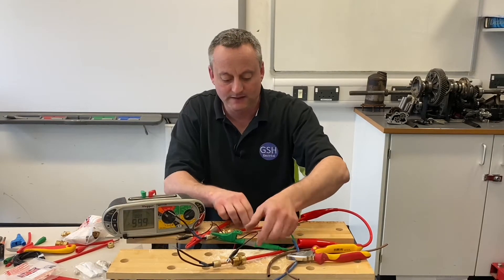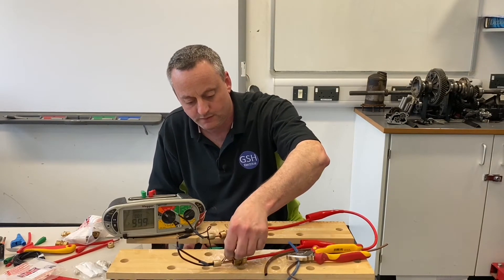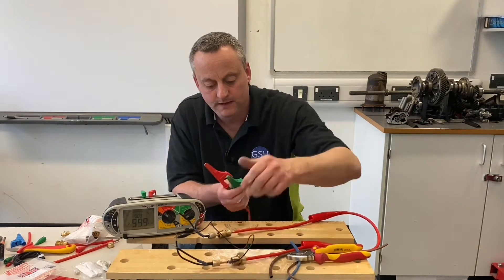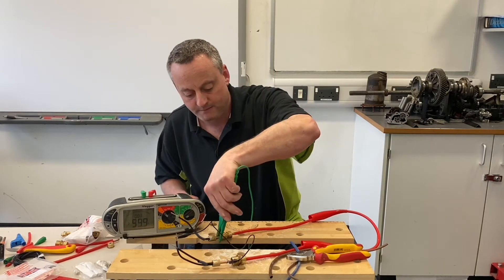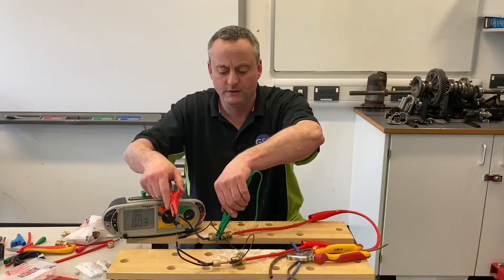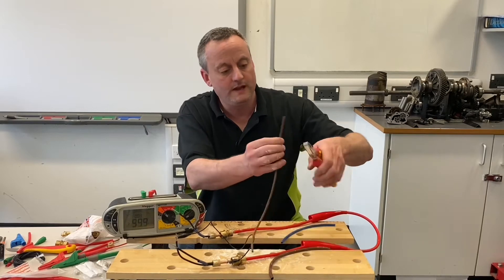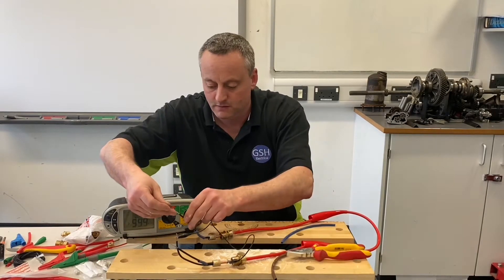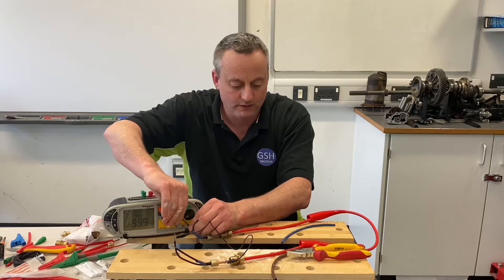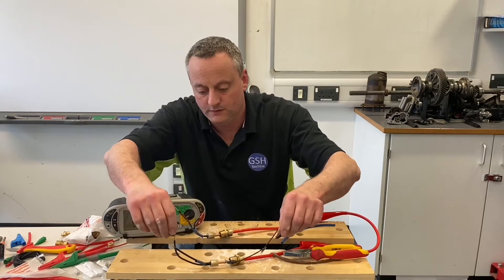We link these two together and come down this end to prove we did get it right. That's in the panel — we wouldn't normally do this — but we come down here, go onto the body and onto the conductor, and we expect to see a low reading on the meter, which confirms we've identified that conductor. You don't need to identify both conductors unless you're working with a 7-core, then obviously the process continues. So this time we're going to identify it with some brown sleeving on both ends. Brown sleeving goes on — this one's a little bit tight but goes on perfectly — and we identify those conductors at both ends.